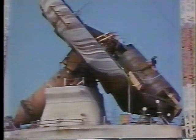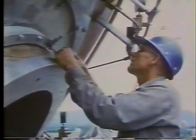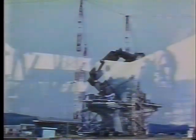But it bounces. The assembly has a natural frequency of 2.1 cycles per second, and the hydraulic system forces oscillations of up to 5/8 of an inch vertically about the polar axis. The vibration is controlled by reducing the oil film thickness most of the time. Observatory personnel take over rotation. The contractor begins installation of the permanent polar drive gear around the counterweight section of the yoke. The gear girder plates are welded in place and torch cut to the proper radius as the structure is rotated about its polar axis.